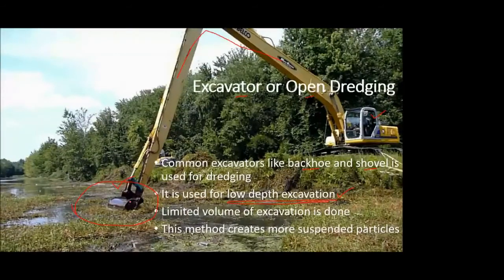There is also a limitation on volume — only as much material as the bucket volume can be collected in one drag. Grab buckets have volumes ranging from 1 cubic meter to 20 cubic meters, whereas excavator buckets have much less capacity, often less than 1 cubic meter, so only a limited amount of material can be excavated at any one time.